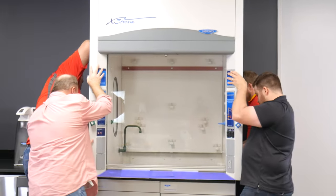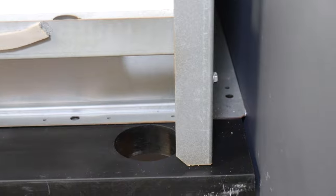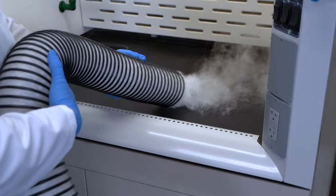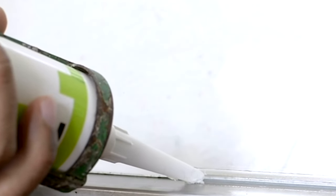Do not lift the hood by its front airfoil. Place the hood so that the rear angle is flush with the back edge of the work surface. The remaining overhang at the front allows for proper airflow. The fume hood should be sealed where it meets the work surface to prevent spilled materials from collecting between them. Seal the hood by applying a bead of RTV sealant between the hood and the work surface.